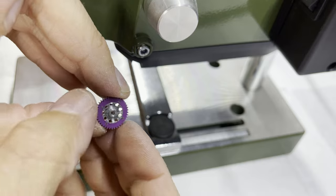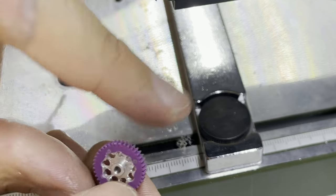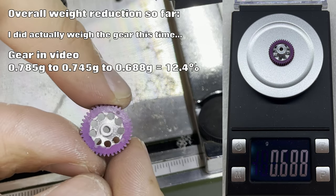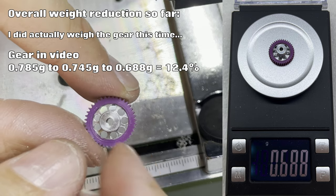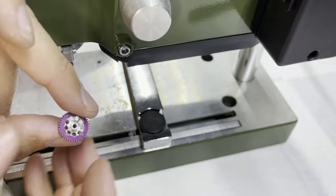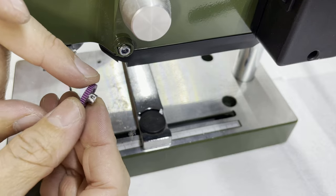These clean up a bit better on the back — drilled all the way through. After drilling with the 1.5mm drill I decided to go all out and opened the holes up to 1.9mm — didn't quite risk 2mm but these are 1.9mm holes. I'll put a picture on screen showing how much more weight I managed to remove — it's quite considerable. Considering this has an aluminium boss, I probably wouldn't do this if it had a plastic rim because then the whole gear would be lighter anyway. But because it has the aluminium rim it's worth lightening it even more. You can let me know in the comments if you think it's going to work or be too weak. I'm going to use this at the 1/32nd Nationals coming up very soon in the UK.